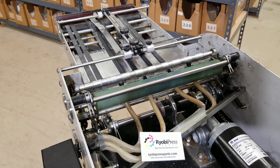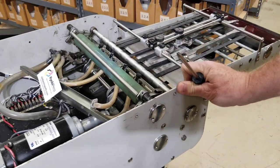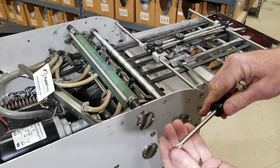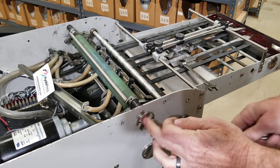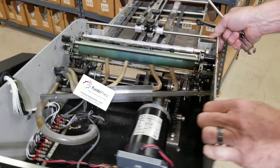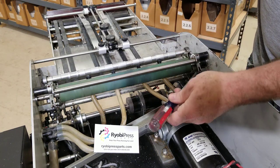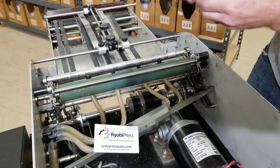And you're going to take the Phillips again and pull out these little end caps here. I've already got them out on this one just to speed things up a little bit. There's a little tiny Phillips screw that you pull out of there — both sides. So we're going to take this bearing cap out of there. That's where we may need the hammer and the screwdriver. Sometimes these, if they haven't been out in a while, you've got to get right on the edge of that and just tap it a little bit to get that cap out.